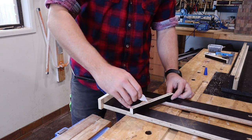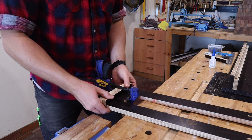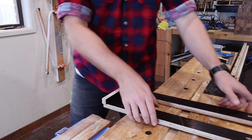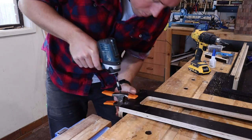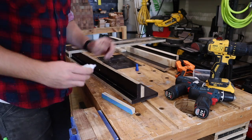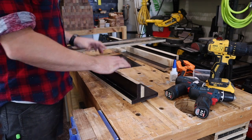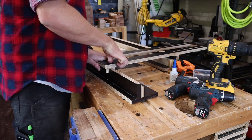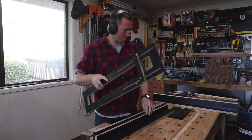The front end of the sled has a guide to keep the sled square to the piece, and stop it sliding off the supports and potentially gouging or damaging whatever's being flattened. The first piece is just stuck on with some super glue using an off-cut to keep it flush with the front edge, before being secured with one of the 8000 screws used in the construction of this. The second piece is installed the same way, and as you can see, it sits on that lower rail to track along it. I used some blue tape on that second piece to give a minute gap to stop it binding to the track, but this wasn't actually necessary as form ply is plenty slippery enough.